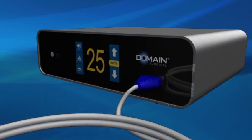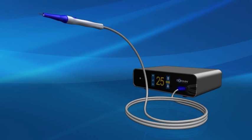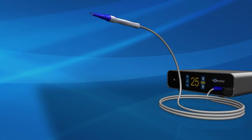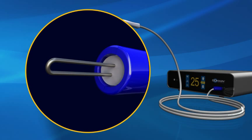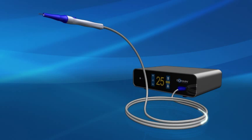The FM1 generator introduces a high-frequency electrical current to the ergonomic handpiece. This current creates a rapidly alternating magnetic field in the wire heating element. As the magnetic domains in the proprietary alloy-plated tip rapidly realign, pure thermal energy is produced. The alternating current completes its return to ground through the handpiece and generator.